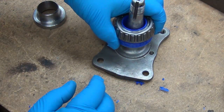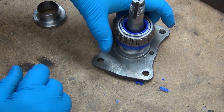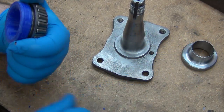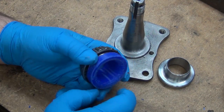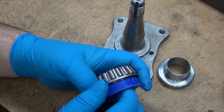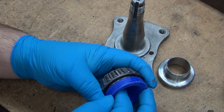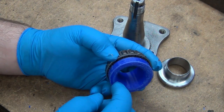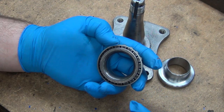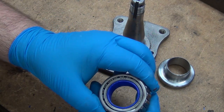For prototyping I'd want to see the height and the fit, put the hub on, and see how well everything lined up without having to make a metal one. The metal one on the manual lathe took about 45 minutes; on the CNC lathe, both sides take maybe 15 to 20 minutes. This plastic piece took 45 minutes, but somebody else printed it, so it was their time, not mine — which is awesome.